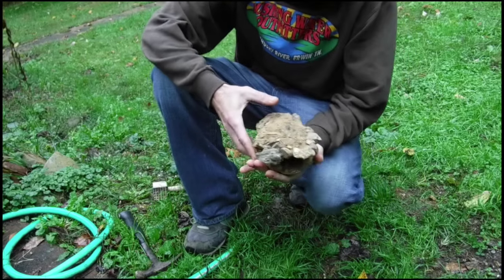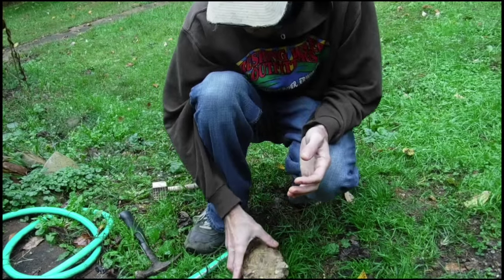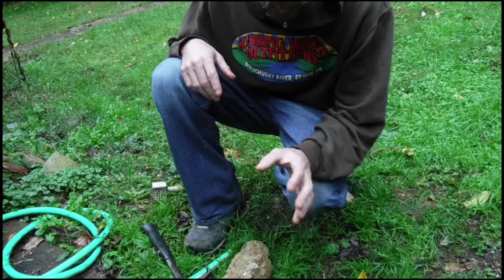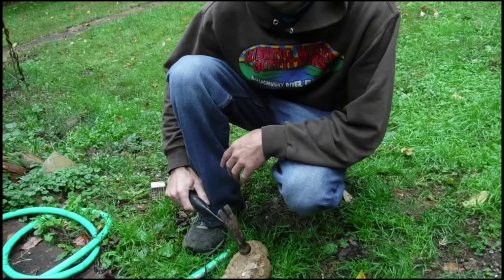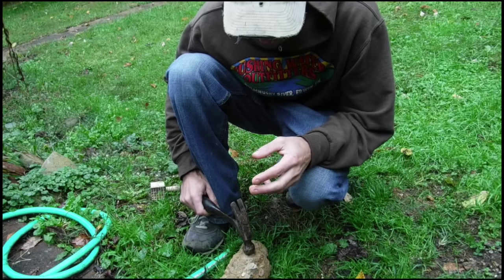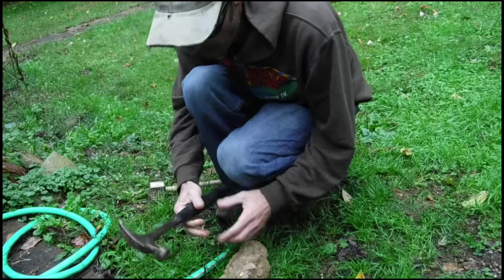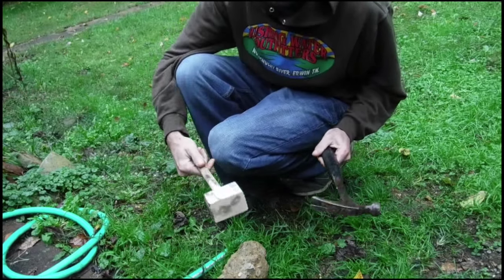The first thing we're going to do is knock off most of this rock. When you're hitting this with a hammer — and we're going to use a hammer to do this — you want to be gentle. I know it's a shell, it's iron, but they can break. I broke a base cup when I was cleaning one by hammering on it. So I only recommend this hammer if you have big rocks like this, and we're just going to do it lightly. We'll let electrolysis do most of the work. And if you get down to finer stuff, I switch over to this wooden kitchen mallet so that I know I'm not going to do damage.